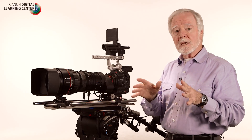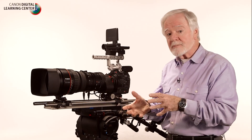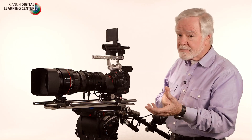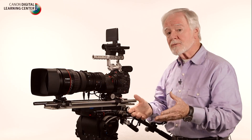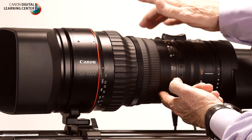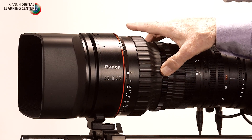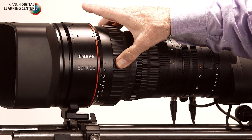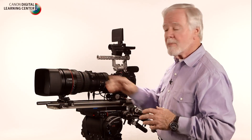There was also a strong plea from the television community that they don't want 300 degrees of rotation on focus for their type of shooting. They might be tracking animals moving rapidly and need to keep them in focus, sometimes manually. So we restrained the rotation to 180 degrees on the focus of this lens, as opposed to the 300 degrees on our other cine lenses. For focus control, there is a ring that engages with the servo drive unit. There is also a separate ring with a 0.8 millimeter pitch for interfacing with standard drive units. And for manual operation, a large rubberized ring gives tremendous tactile feel for precision rack focusing by the cinematographer.